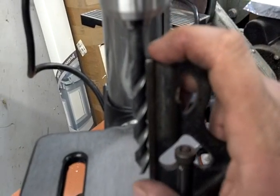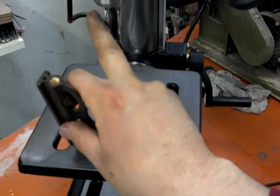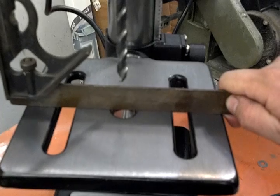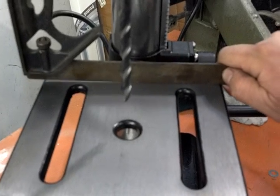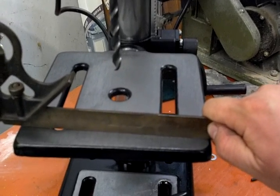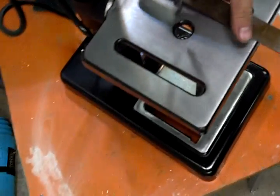What I did find was when I went to go square this thing up and tossed my square on there, there was a minor gap at the top — it touches here and there was a gap up here. I flipped it around and had the exact same thing on the other side. The plate is not flat. It is ground, but it is not machined — it's like somebody just ran it on a monstrous belt sander. So side to side it has a rock, but front to back is actually straight. I was kind of surprised by that — it is straight lengthwise.